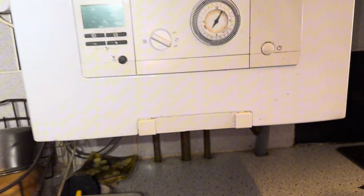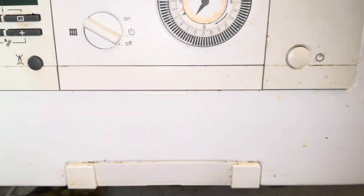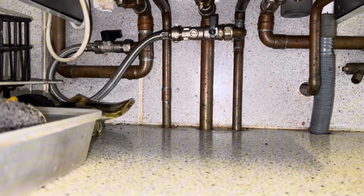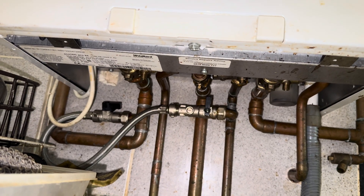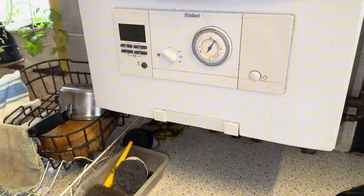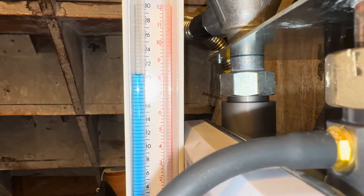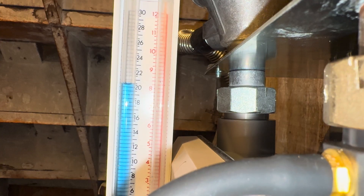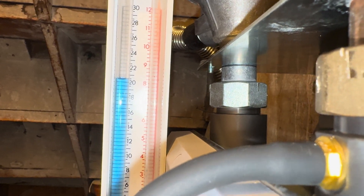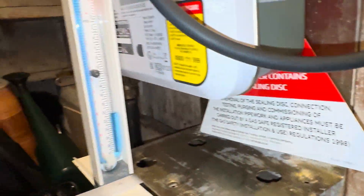Obviously I'll test the visible joints first with LDF. There's no smell of gas — something leaking that much will be pouring out. In the interest of doing the job properly we'll test that and then talk about a new gas run. No success today guys — just to prove, the cap's back in the outlet and no drop. So it's going to be under the floor, which is concrete and laminate — concrete under laminate.